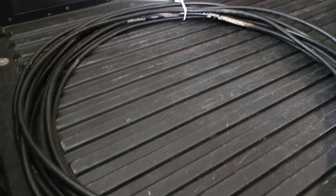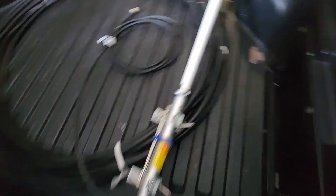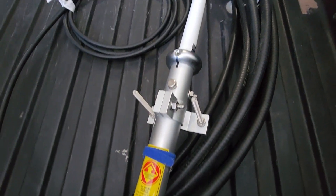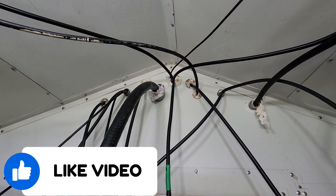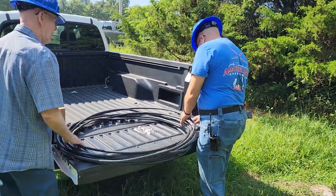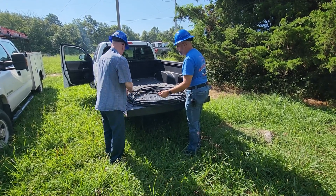It's time to get back to troubleshooting our repeater. We've been having problems with the receive on the repeater — transmit seems to be getting out just fine, but coming directly into the repeater was not working well. AC4DM had some hard line laying around, plus we've got a number of GP3 antennas in our inventory that we use for the gravel rally. We had a storm go through about three months ago that tore up towers all over Kentucky and Tennessee, and we thought we might have water damage or the antenna was damaged. So let's use some of this hard line and also replace the antenna on top, just in case.